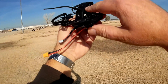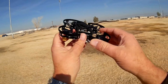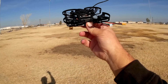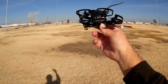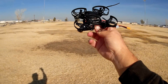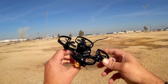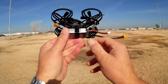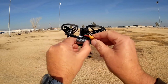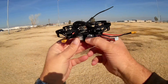If you get plug-and-play, you're going to have to install your own receiver. To access the receiver, you remove this screw here and this screw here, and this panel pivots out so you can plug in a little micro receiver in there. The one I got here is a bind-and-fly with a FrSky receiver — it's D16, so you're going to need to set your transmitter to D16 if you have a FrSky transmitter. Also, this quadcopter did not come with a battery. It's capable of using 2S or 3S batteries, and it uses an XT30 connector.